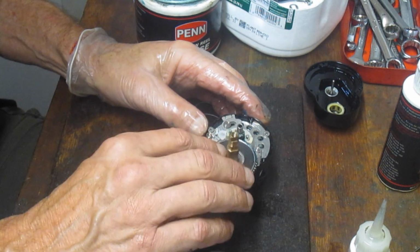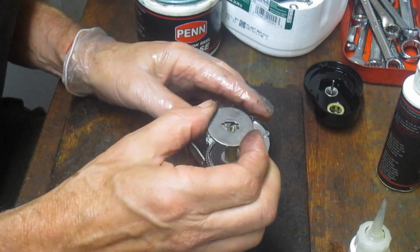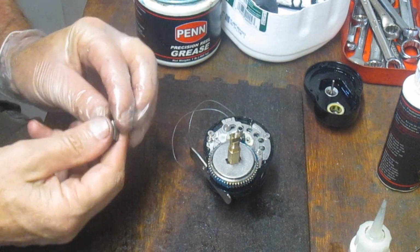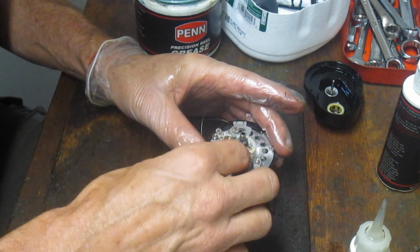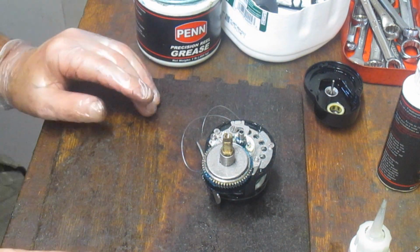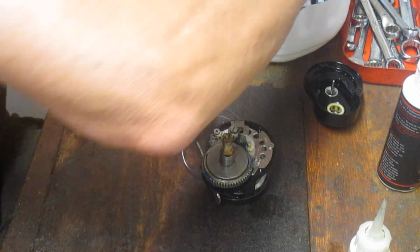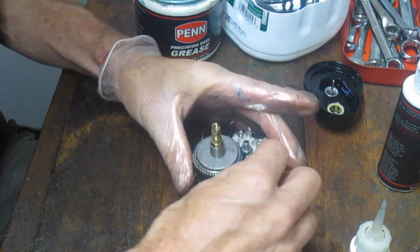Top one. And then we have the one that is going to accept the gear sleeve. And I'm going to go into the basket right now and get that gear sleeve one. They have the 2 teeth, and I prefer to put that on here when I load a case as opposed to putting it into the anti-reverse clutch and then finding out that you're having all kinds of trouble getting those teeth to align. Everything is set here except for the springs. So let's go put the springs on.